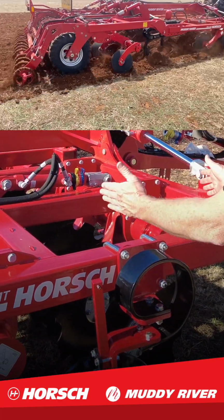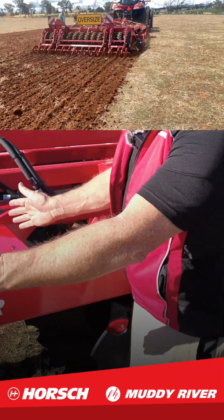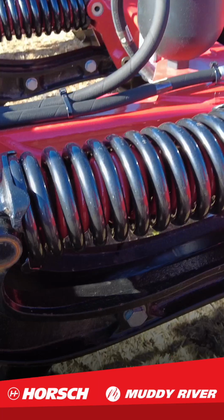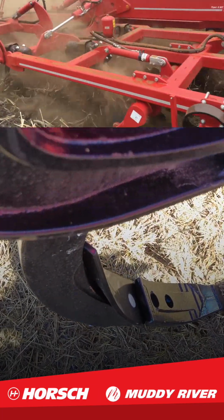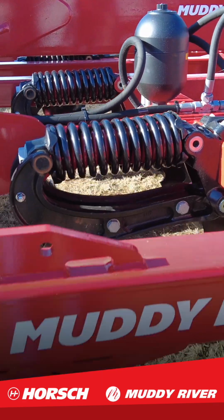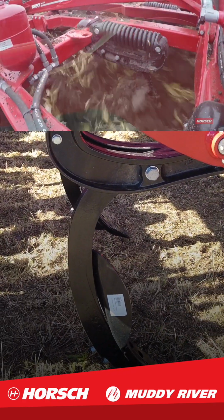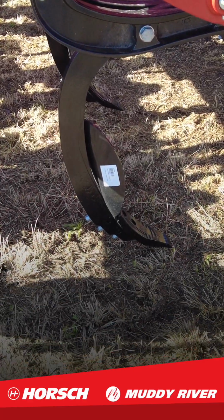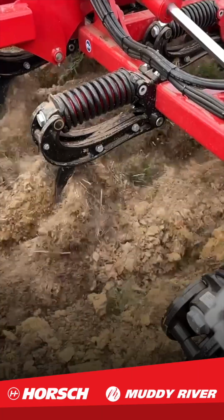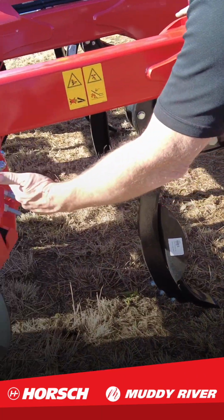And then you move on from the disc system here, back to the tine system. So these tines here, they're what's called the TerraGrip 3N, and they're 770 kilos breakout force. Similar design with the edge plates and the HM Plus points and all the twisted shank guards right across the machine to get the soil to flow a certain way. Then you come back into the levelling disc.